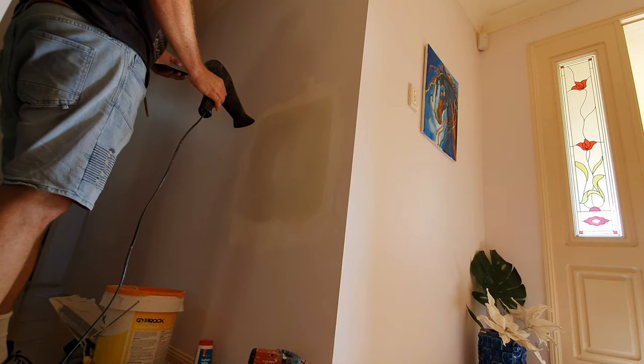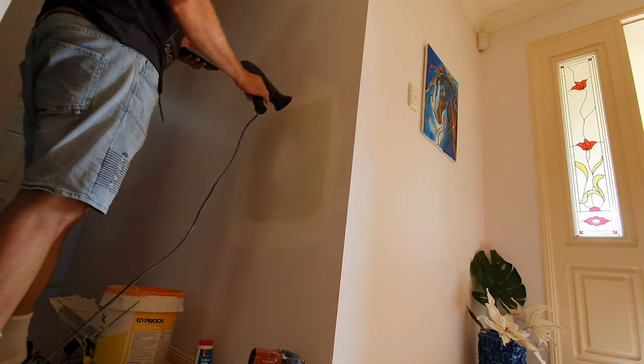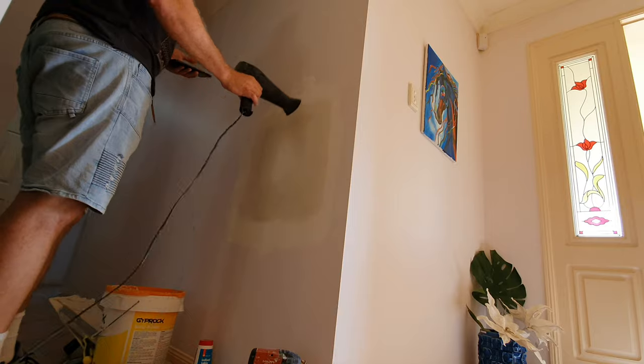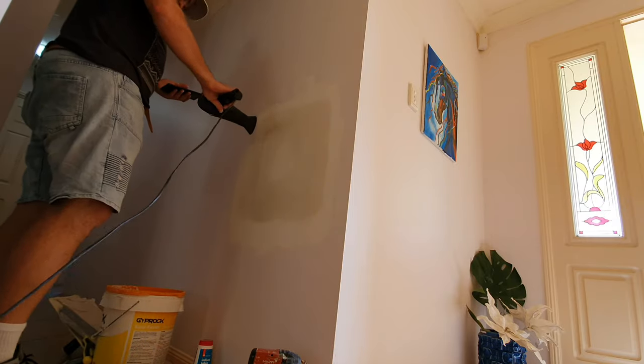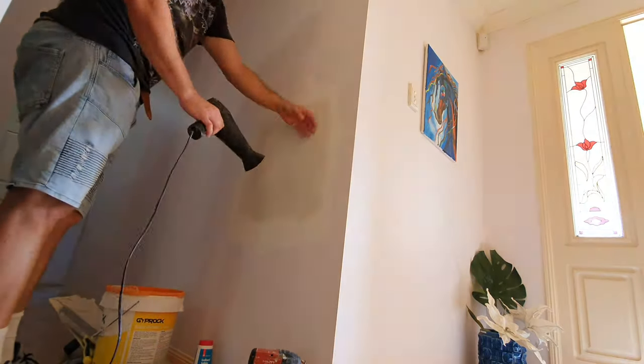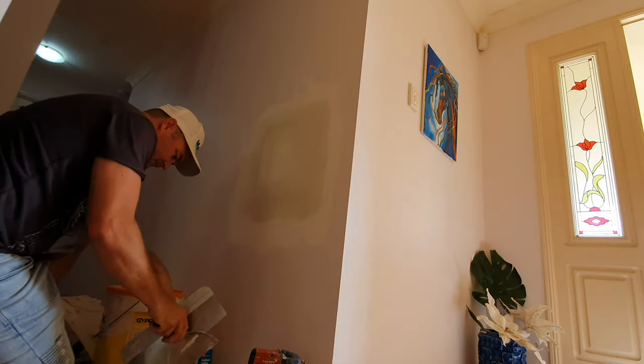Multi-purpose just stays soft for too long and it shrinks. You want to dry this as much as you can, especially if you're going to be painting the same day. In this case it's not getting painted today, so it can remain wet on the wall overnight — I've just dried it enough to apply the next coat.